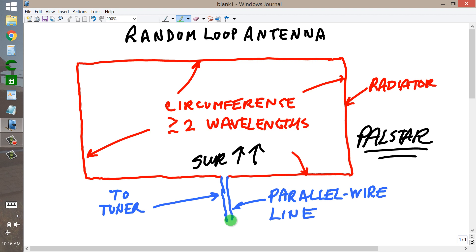Adequate lightning protection is mandatory with a huge antenna like this. I'd recommend disconnecting the antenna and grounding it away from the station so that if lightning does happen to hit the antenna or create a large electrostatic pulse, you will not have any damage to your station, your house won't burn down, and other bad things won't happen. Your antenna might get vaporized, but wire is relatively cheap — although this wire could be hundreds of meters long, possibly even a mile or so. The ideal shape for such an antenna would be a circle; next best would be a square. You don't want to make it too elongated.